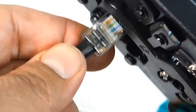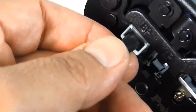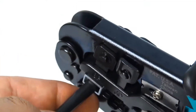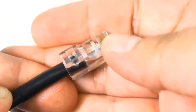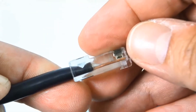Now let's go back to our plug that we terminated here. Go ahead and use a crimp tool and crimp it down. Some crimp tools have a locking mechanism where once you have it crimped properly it'll release. Actually, they all should have that if you've got a good tool. There we go, it looks pretty good. See that? There's that little crimp piece that we needed to get the jacket passed.